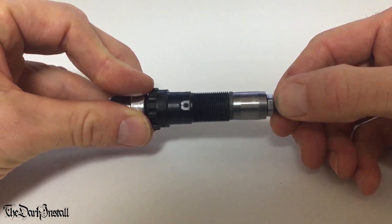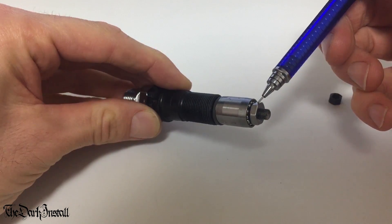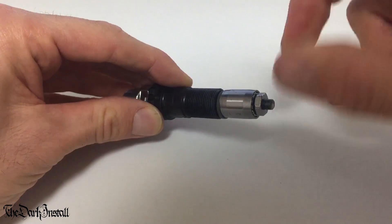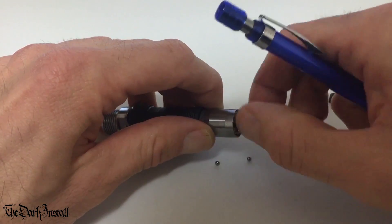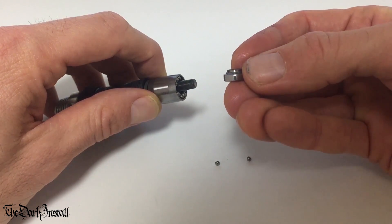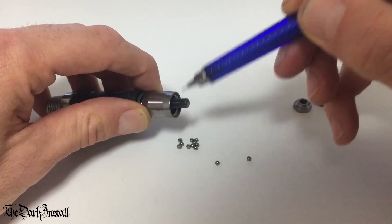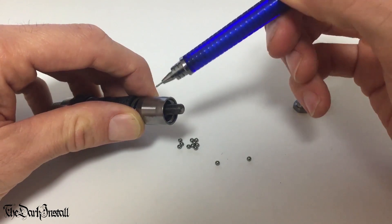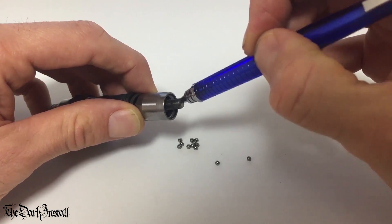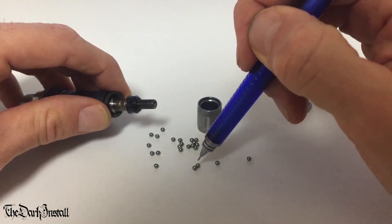Let's go into some detail about the axle - how is it put together? First of all, we'll take off the end locking nut. You can see this part's threaded. This part, which is the other side of the locking nut, this side is flat. Inside here is the top of the angular contact bearing race. So when I undo this, the balls are going to fall out. You can see the top part of this nut is actually ramped, concaved, and forms the top of the angular contact bearing race. There are 12 ball bearings in total on this part. Next up, this here is essentially the outer race of the bearing and the part that presses into the pedal body - it's got a race here as well. Another 12 balls. So 24 balls in total, and very small.